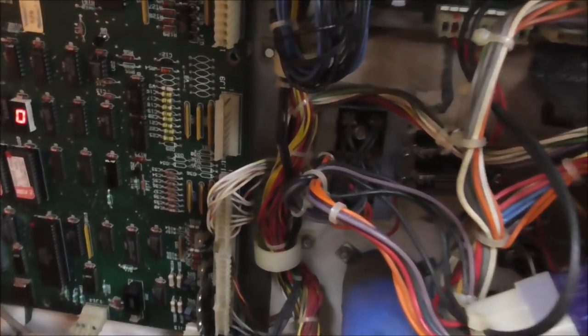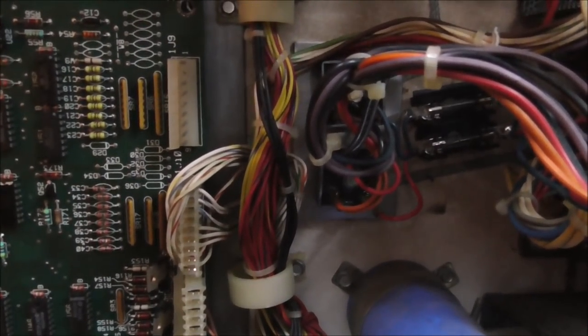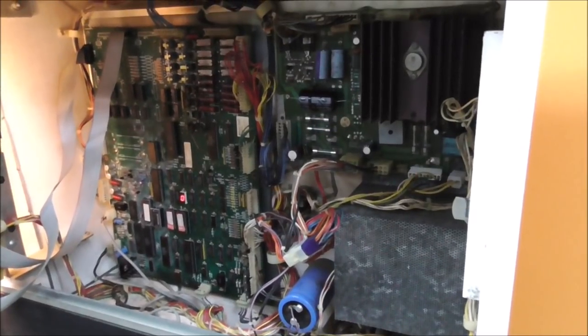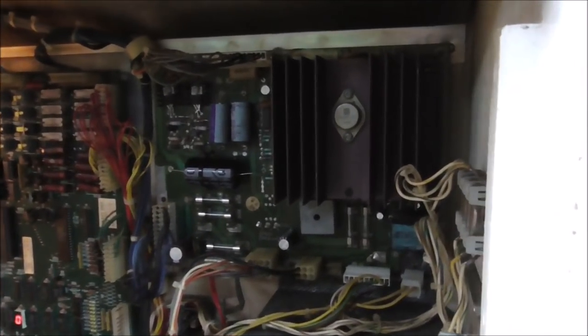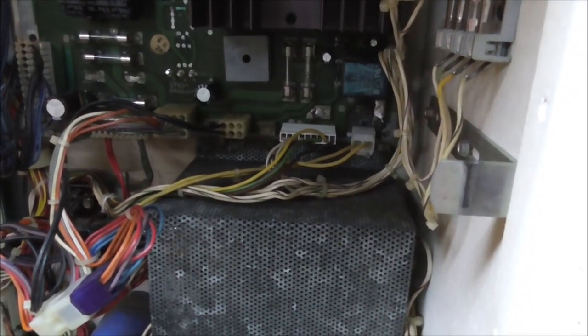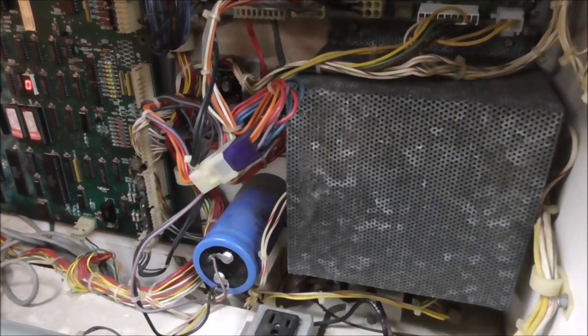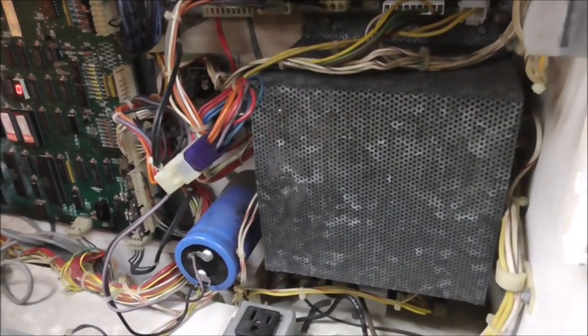The wires were perfectly long enough. I moved the two bridges slightly to the left, put my two fuses in there, made sure they're not touching anything or anywhere near anything where they can short out. I've got my two 8-amp fuses in there. The power supply is done — we replaced the connectors, and put the two fuses on the bridge rectifiers.